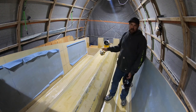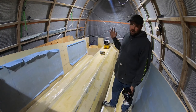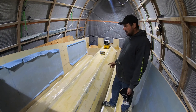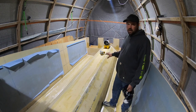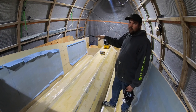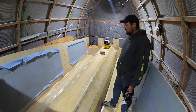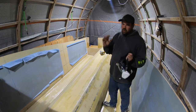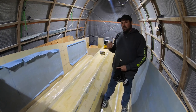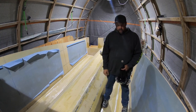After that, I'm going to set up all my taped blocks, and those will just be stoppers for where the bulkhead actually goes against. Then Cassie and I are going to probably trace out the template she made the other night, and figure out what our beam should be at that bulkhead. We do have all the dimensions in our prints for that, and then we have to adjust a little bit accordingly. Again, we're going to get everything where it should be according to the prints. That's kind of what we did on Bulkhead 2, and it worked out quite well for us.